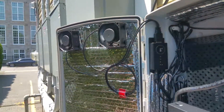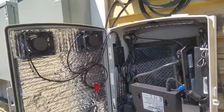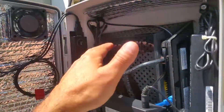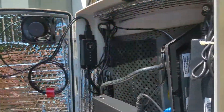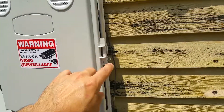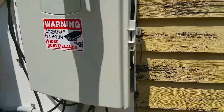The fans only come on when it reaches a certain temperature — I have it set to 84 degrees and above. It's been working great, cooling down the cabinet. You can see it's an extremely sunny area and it gets close to 100 degrees in here. Without these exhaust vents it just wasn't working. You can also put a combination lock on this cabinet, which I do have right here.